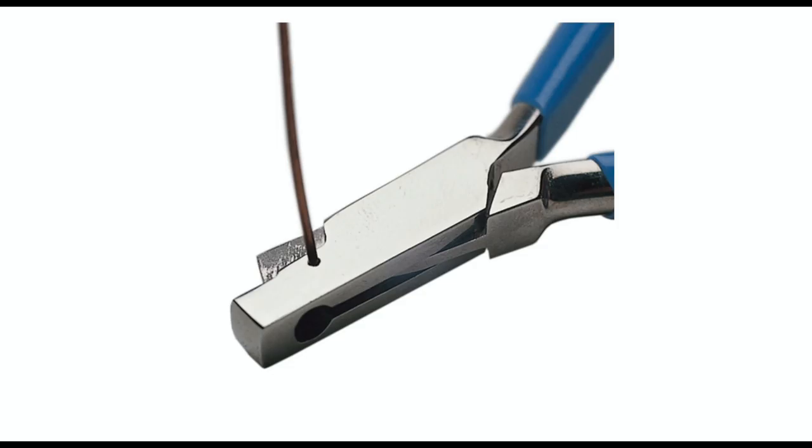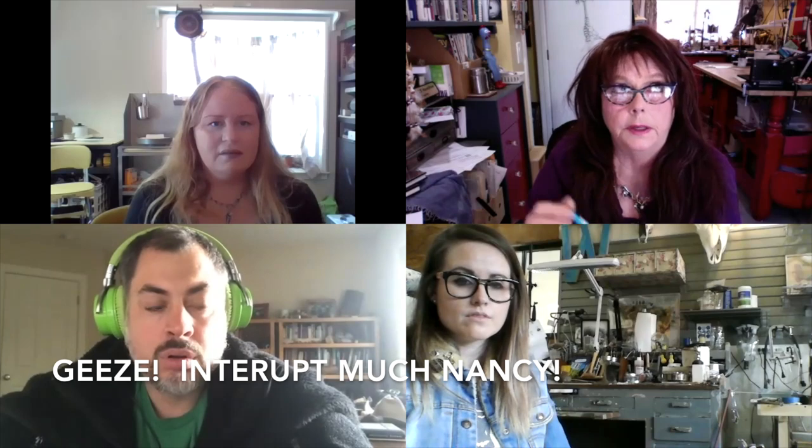Oh, yeah. I mean, for solder, I don't like using the scissors. I prefer using little cutters, and I end up using the flush cutters for that for some reason. Oh, really? There's a tip that I came across, and I did a video on my YouTube channel for solder cutters. You know the kind with a square jaw that comes down, used for sheet or whatever? I've taken those and drilled a hole in the side of them so that I can insert wire, and that way I can quickly cut wire the same width every single time and just feed it in. What I like about wire is that you have to cut such tiny pieces, because I'm a proponent of absolutely minimal solder.